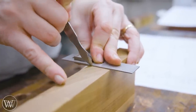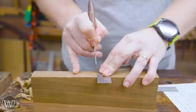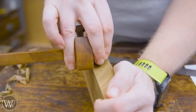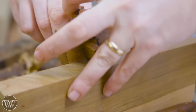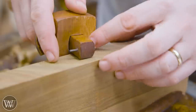The first thing you should cut out is the actual slot that the iron goes into. This is a little daunting — we're not making this laminated, it's going to be out of a solid piece. So cutting that tapered long mortise for the iron to fit down into is a little more difficult. It's off-centered because there will be a fence on one side.